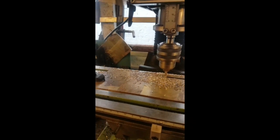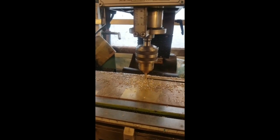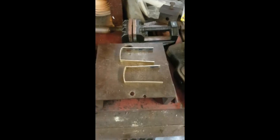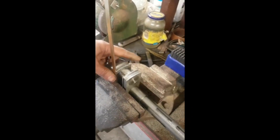As you can see I'm just taking a slither off a brass plate with a 6mm cutter pretty much. I've made two of the straps already and it's just a simple job of placing them in the vise and bending them around with a clamp across there.